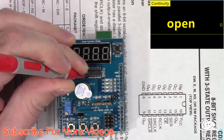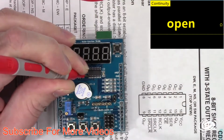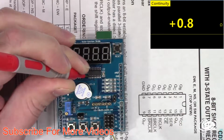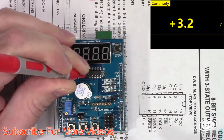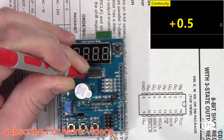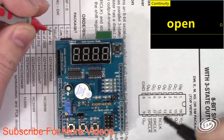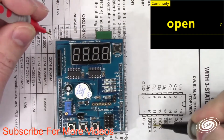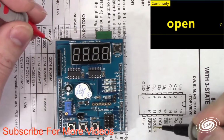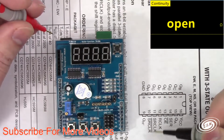Is that tied high through a resistor? Wow, that is just straight tied high. Not even a pull-up resistor on the clear. That's just crazy. Not even a pull-up resistor on that storage register clear. Normally you want to put a pull-up resistor on there, like 1K or whatnot.